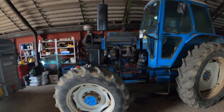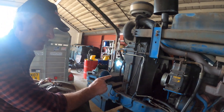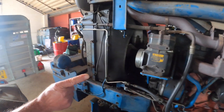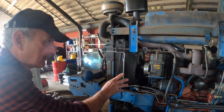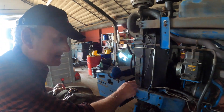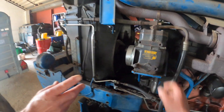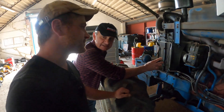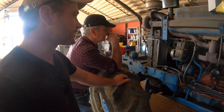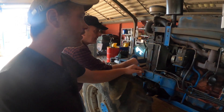So we've got a Ford 7710, 1983. My favourite, this one. It's in the workshop because it's had a few bits done to it. It started off with a slight leak, but what really started it off — we've probably mentioned this before — it threw a belt on the aircon, and it's done it more than once. We wanted to get to the bottom of that, but we went one step further — water pump, belts, top hoses — and we did find that the radiator was leaking too, so it's had a new radiator as well. We're going to try and re-align the air compressor — it's only a fraction out, not enough to throw the belt I don't think, but we're making sure it's had a new belt. The temperature gauge sender had gone too — it was reading hot when it wasn't hot, and that works now.